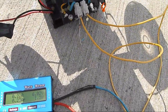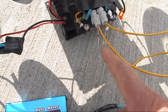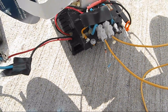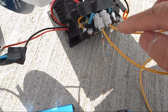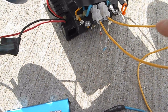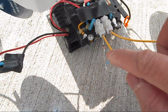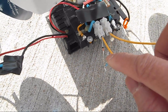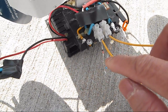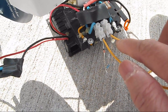What I've been trying to do with this solar power pack is make a crude LED indicator light so that when the battery reaches 5.6 volts it would light up, but unfortunately it doesn't seem to do so. This Zener diode is rated at 5.6 volt breakdown voltage, but I had to use quite a bit over 5.6 volts to get the LED to light.